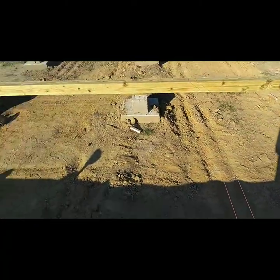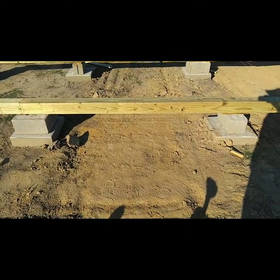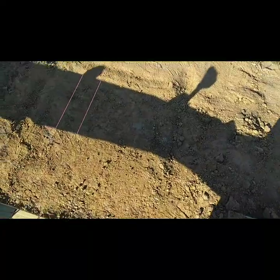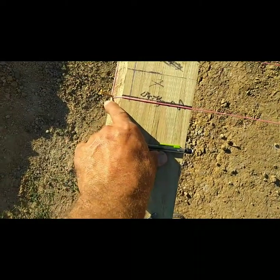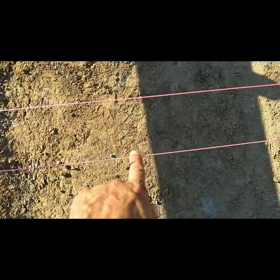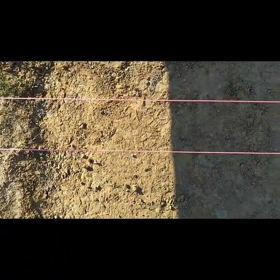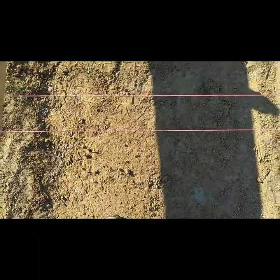This wall doesn't have any plumbing on it. This one does — it's 5'8" in between these two walls. My tub will go right here where I'm standing. What you do is measure from the outside 3.5 inches in, and then you'll get a mark like this. Then you'll measure 15 to 16 inches in, depending on how wide your tub is. We're probably going to put a 30-inch tub, so we'll go 15 inches to the center. That's where we'll start with our drain pipe and our P-trap.